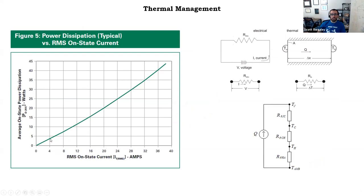Lastly, a lot of these things burn power. For example, a triac passing 20 amps will burn 20 watts of heat — a huge amount, especially left on over time in an enclosure. Make sure you're doing thermal calculations. There are Google resources and some really fun things you can learn; it's not super hard to get into.